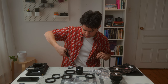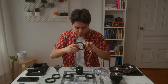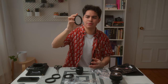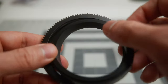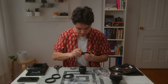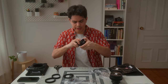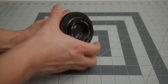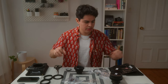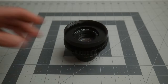After applying the tape it turns out to be exactly the right width, fitting snugly against the little ridge inside. After the tape is inside the metal ring you put the rubber ring in, set focus to infinity, and slide it on. That's a lot tighter now — it doesn't move at all. No matter how much I roll it, it rotates the whole lens. Then the last front ring, which is a 52 to 77mm, goes on and that's it.